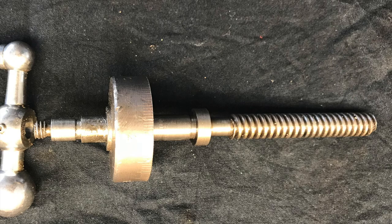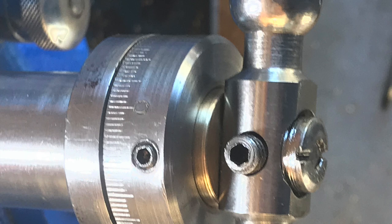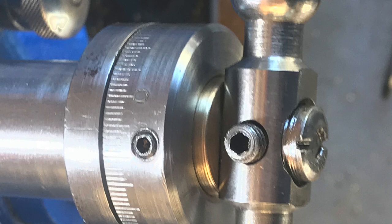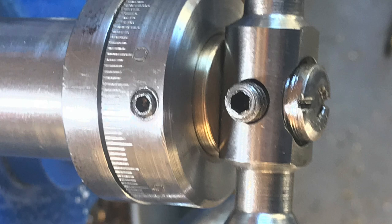Because this is an unusual thread, they're difficult to make and almost impossible to buy as replacements, and if you can find them they're very expensive. I'll talk about replacing the nut in another episode, but today we're talking about backlash from the dial. The dial itself can contribute a lot to backlash — if you grab hold of the handle and move it backwards and forwards, you can see a gap opening up beside the dial. That's the problem contributing to backlash.